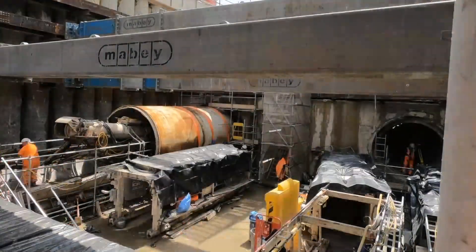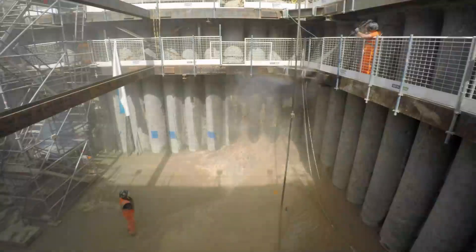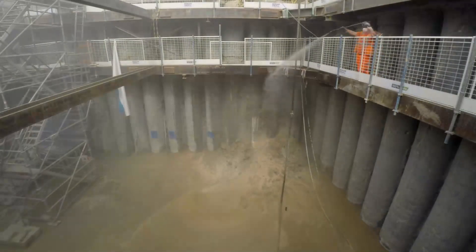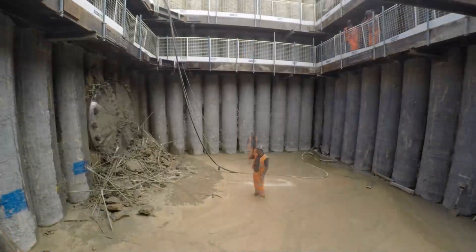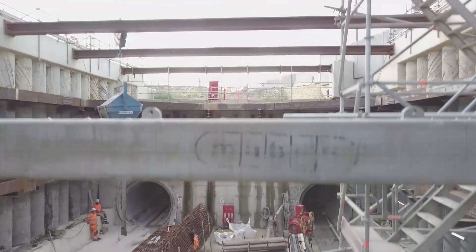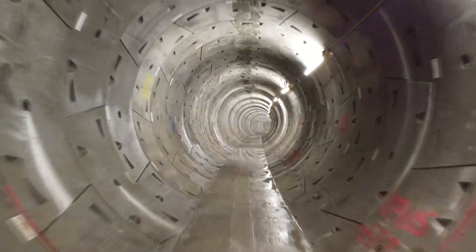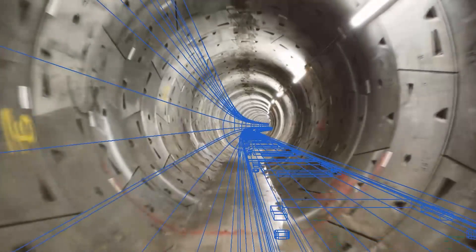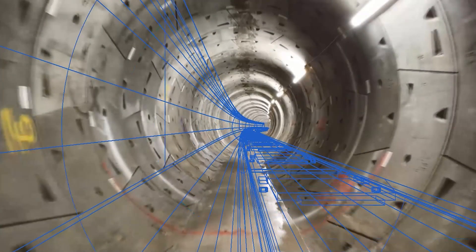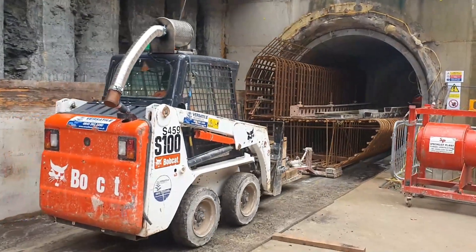As part of the scheme, we've had to install two guide tunnels underneath the East Coast Main Line. They're about seven metres deep and also on a 750 metre curve. The next stage is to fit them with the concrete foundation and guide walls. As we dig and push the box, we'll expose the top of the tunnels as we move the box, uncovering the guide path just in front of the excavation. We'll be able to push around the curve of the box guided by the guide tunnels.